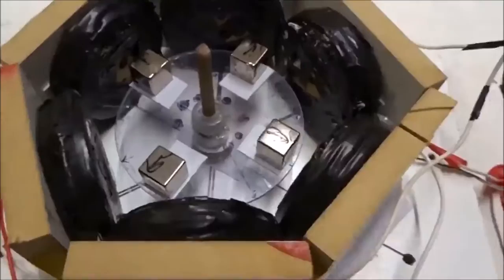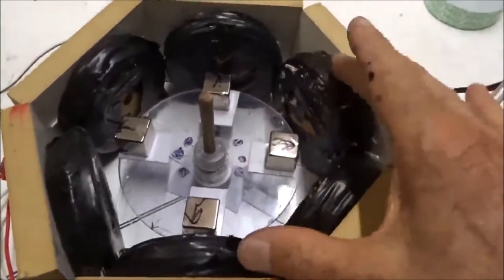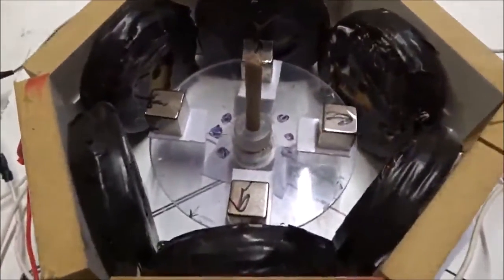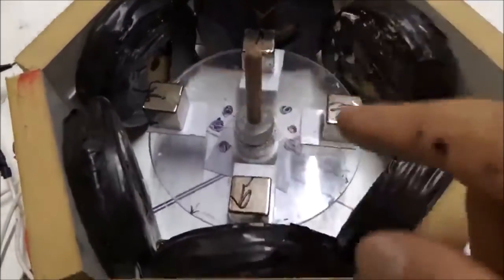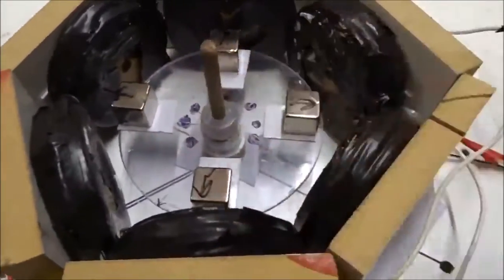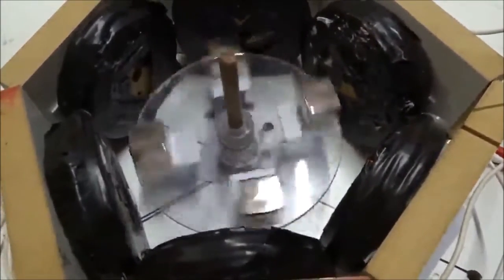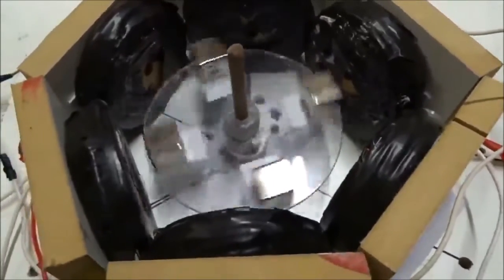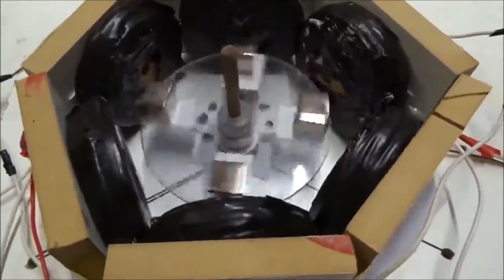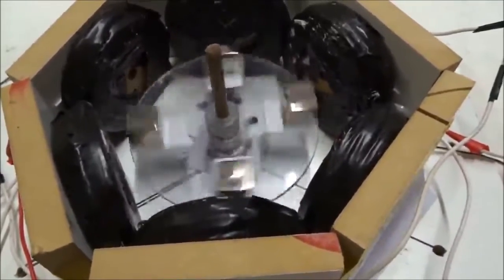We're going to have a little bit more fun. You should recall that with these six-wire coils wired up UVW UVW, our most tightly locked arrangement in smooth turning was NNNN — four magnets arranged in a 90-degree orientation. And when you put on the UVW power, it locks clockwise. So very good. Now, what happens if we change two of the magnets to S? If we change one magnet to S, it made a mess. What happens if we change two?